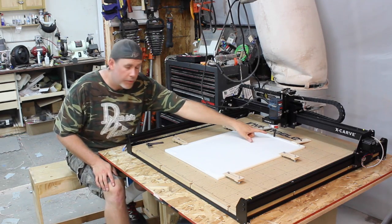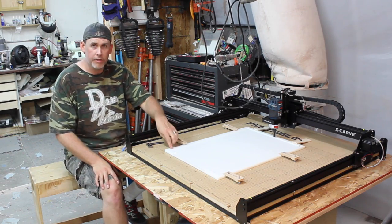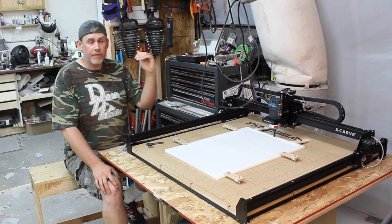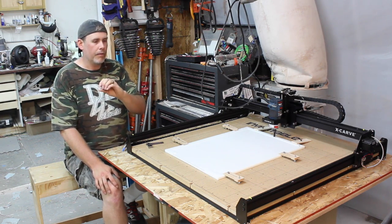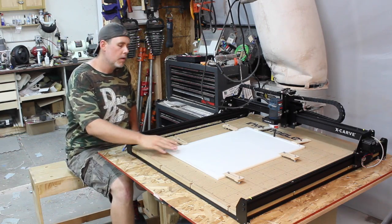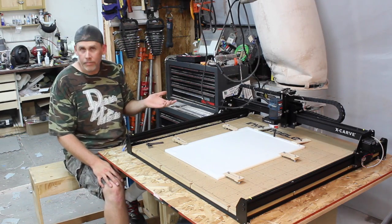Plus I went from a 3/8 inch bit to a 1/2 inch bit to take more at a time. I figured the Bosch should be able to handle that, especially with HDPE. It's pretty soft. So what I did was I upped the feed rate to 40 inches per minute from 15, and the depth per pass I went to 0.05. I didn't want to take a big chunk necessarily deep, but I wanted it to try and zip through this a little better. That worked out better. It probably took an hour maybe.